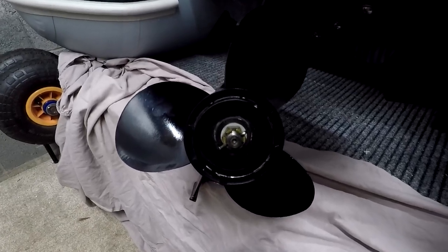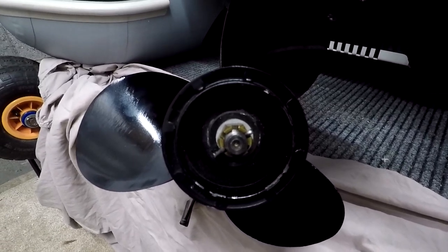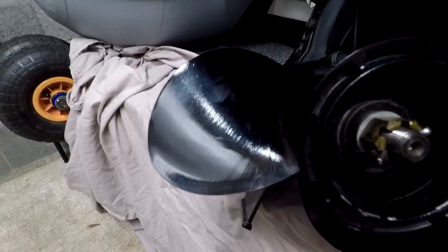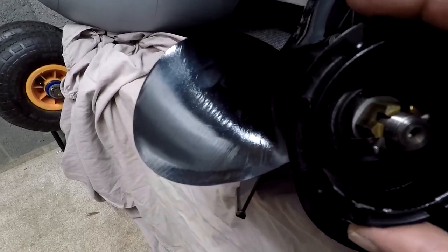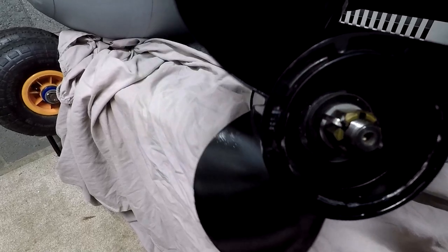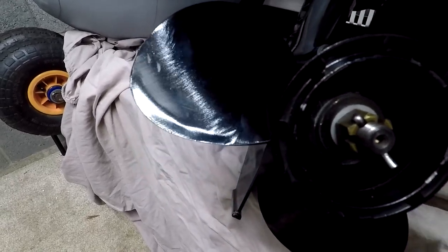When I've raised the engine height before, I've had an issue with ventilation in the prop. As it was close to the surface, it would lose grip and slip in the water. I looked into that and found the way to alleviate it was to get some cupping added to the propeller. You can just see on that trailing edge there — it's now cupped. So when the prop spins, it provides that bit of extra grip and doesn't slip in the water.